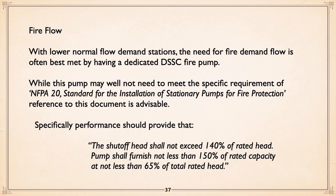pump. Now, by the way, why did NFPA and listing with UL and FM, why did they do that? Insurance. FM and UL both basically are groups of insurance companies. That's the labels that are used. And NFPA 20 standard requires listed pumps, but in this case, you're a municipality, you really don't need to do it. However,